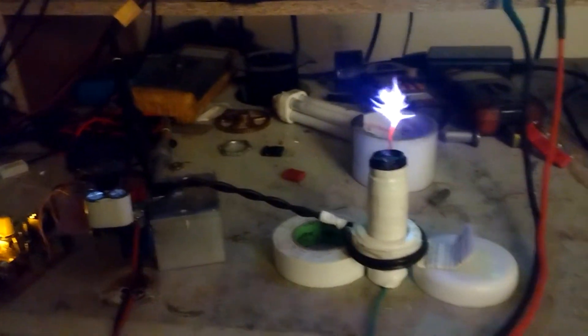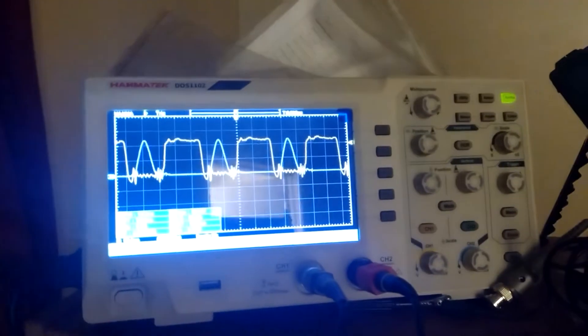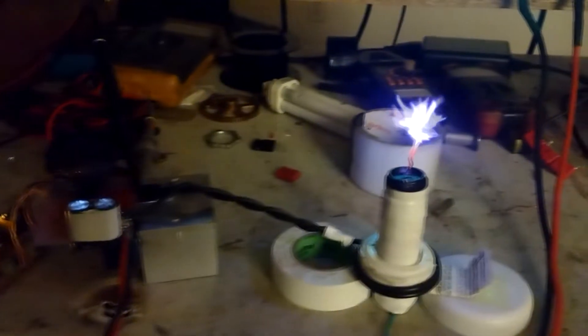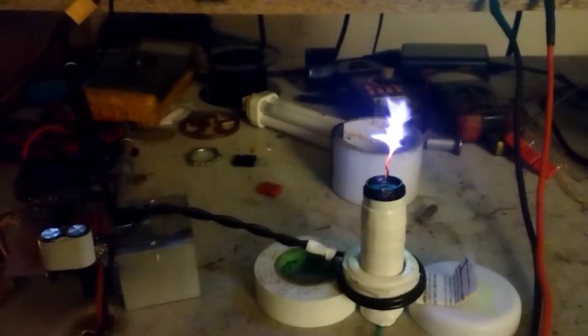Apparently with that switching it'll run — that's not a bad little over-four-megahertz flame there. Technically I could bring it higher; I'm not sure at what point it'll fail. But the higher I bring it, basically the shorter that pulse is going to get — it'll rise higher in amplitude, and eventually it's going to start working that MOSFET a little bit too hard and it's going to start heating up.